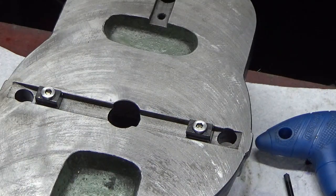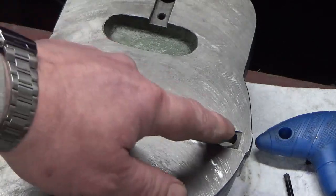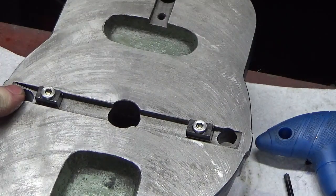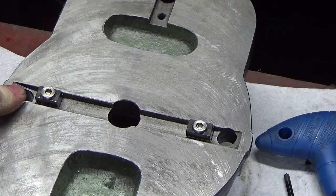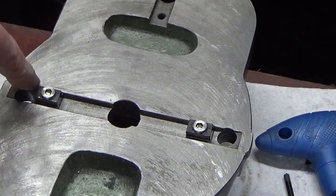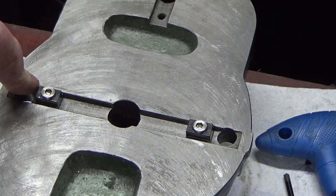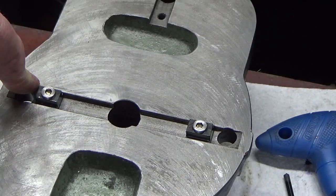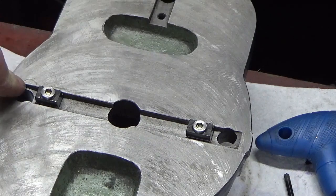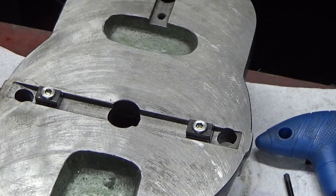So I'm thinking about what we do now. We can either put the vise on, taking the keys out won't make any difference because I still need to clock the vise up anyway, so I've still got the foul condition with the holes, so it's the holes that's the problem. So I can either go without the top hat bushes and just put some washers on the top, which I don't really want to do, or I can try and elongate these holes, which means I've then got ovaled holes, which means the top hat bushes would still function as a washer potentially, but they wouldn't function as a bush, so that's not really, well, it would solve the problem, but I wouldn't be getting the use of the top hat bush. Or I could try and open the holes out bigger but in the right location, and then I lose my bearing surface on the other side.